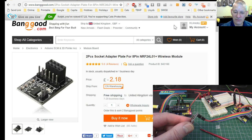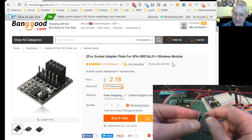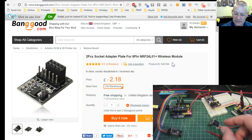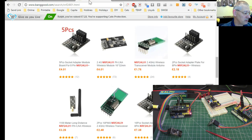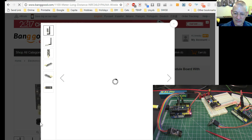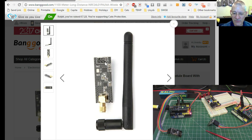I've got a couple of those adapter boards on order. For a project they're much better than bare dupont cables. If you use the higher-power versions — like this one with a walkie-talkie style aerial at £3.26 — you can go up to 100 milliwatts and get easily a couple of kilometers range. So depending on your need, you have a choice.